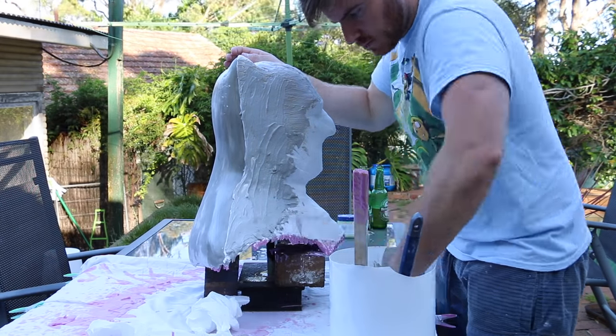Because this is a seamless mold — meaning there's no split up the back of the silicone portion — we have to very carefully peel this off like a glove. I'm baby powdering the entire area so the silicone doesn't stick to itself when I peel it off, because it gets messy if it starts sticking together. Especially with undercuts like the chin and the nose, you want to be really careful and take your time and eventually it will peel off like a glove. I'm then putting the mold all back together and clamping the perimeter of the silicone mold to the Ultra Cal shell mold.